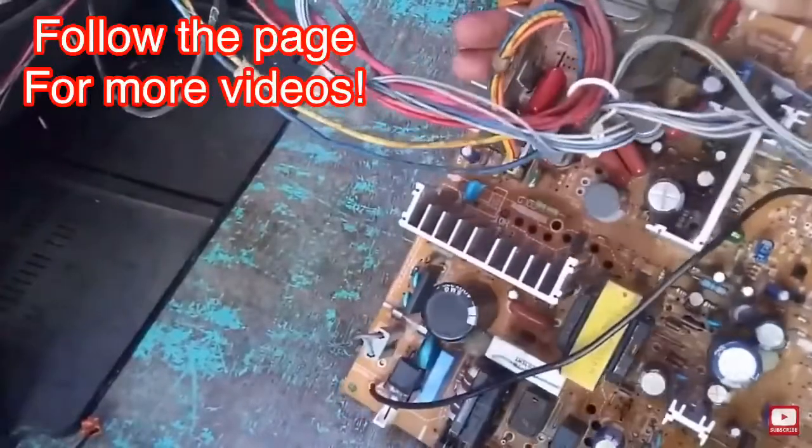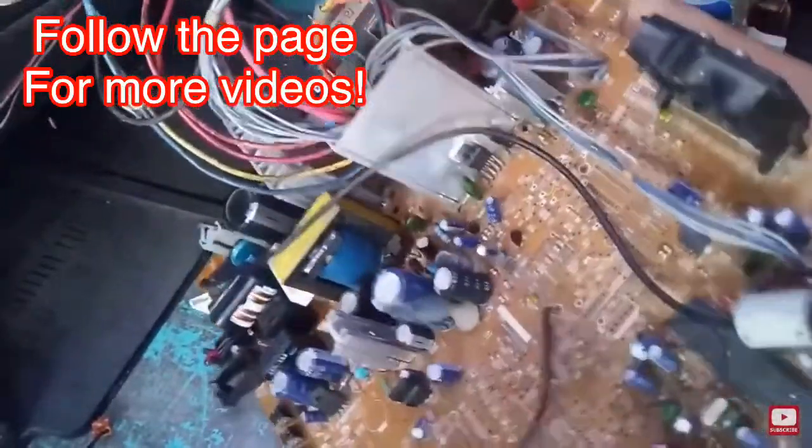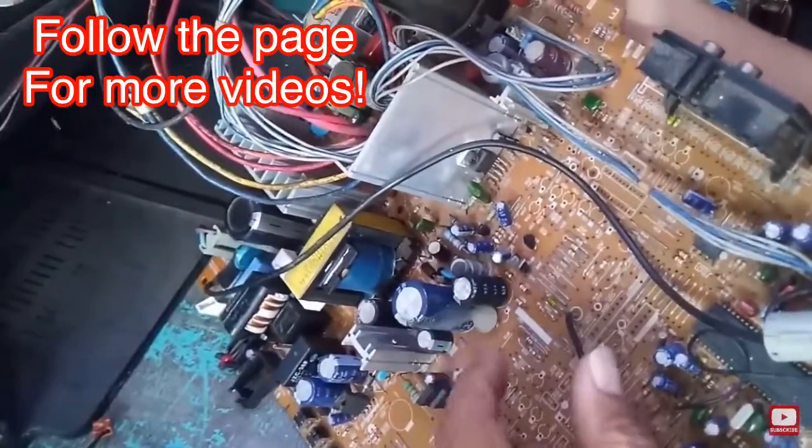Since I don't have 27k ohms, I have these two resistors which I combine in series, and we are going to use this as a replacement for that resistor.